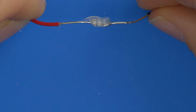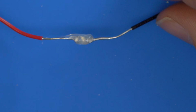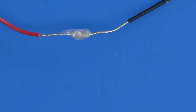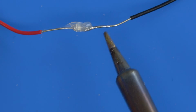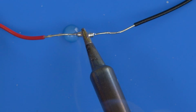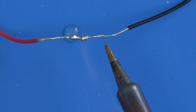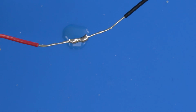And what that will do now is it will make the solder act like it was fresh, if you will, like you've only just applied it, so it will flow. So any of those areas where the solder was dry, or we had any of those sharp edges, you'll see now all I need to do is touch and go along, and it's all flowing nicely into joints. So that's basically the joint now done.